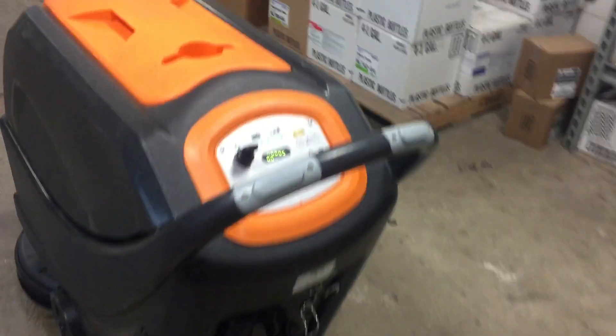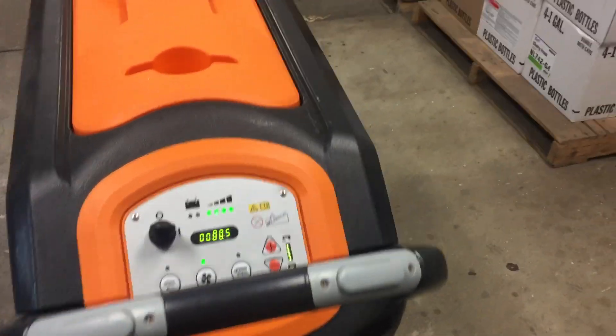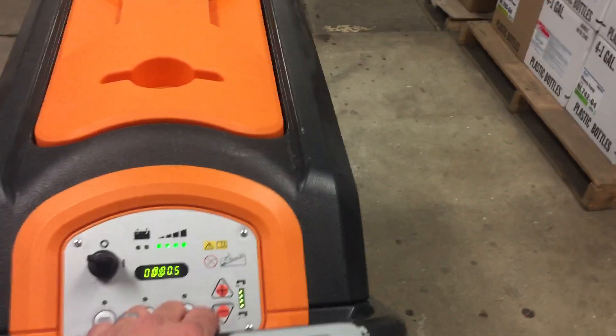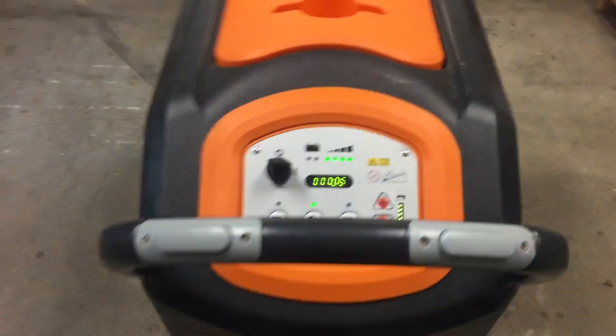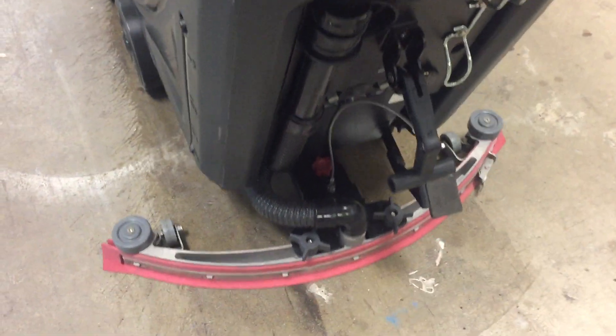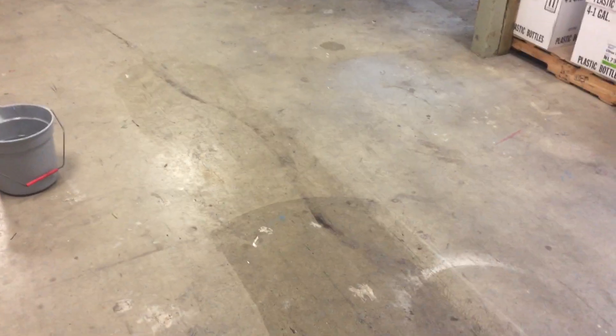When we're done, we're going to turn off our brush. We're going to leave the squeegee on the ground, but I'm going to go ahead and pick my brush up and put it up in the air. I'm going to turn my vac motor back on, and then this water that's still on the floor, we're just going to go along and pick it up. And what you can see behind us is a stretch of floor — there's just not water back there.